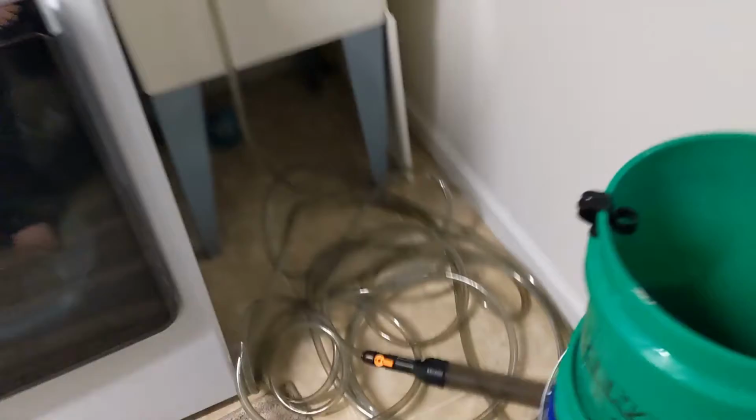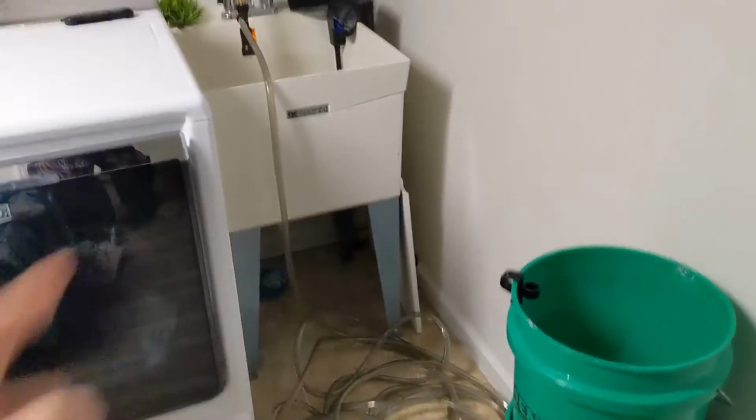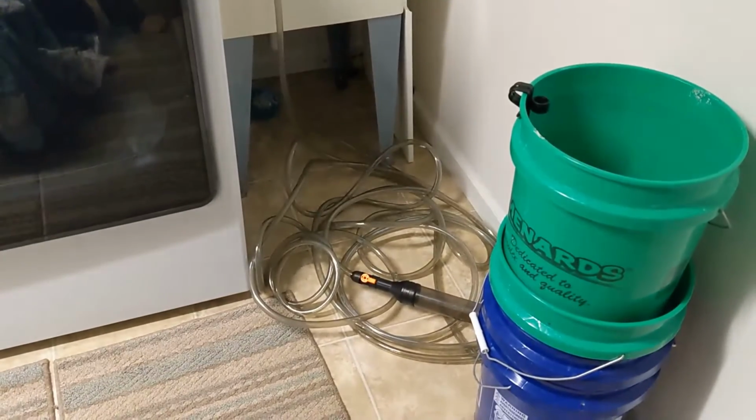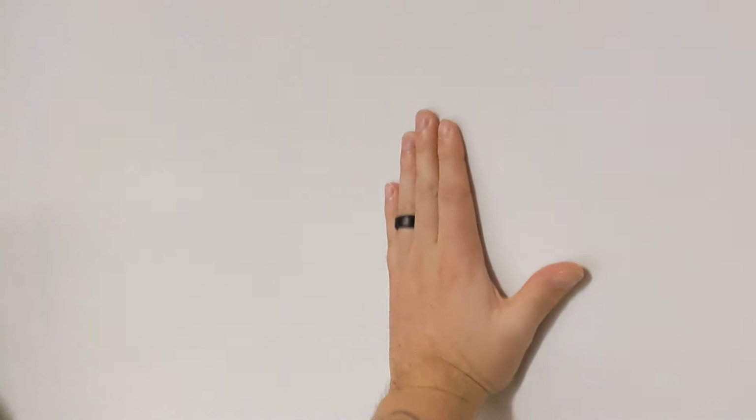So what I'm thinking is coil it up just like you would a garden hose and put a mount right on the wall right here, so that way we can just coil it up on the mount when we're done with it and it won't be all over the floor. Because it's going to be literally just used for hose storage and no one is ever going to see it, I'm thinking we just make a quick and easy mount, literally just a piece of wood up against the wall, a little bracket right here, and then a little ledge so it doesn't slip off, and then the hose will just coil around that little ledge right there. So 3 pieces of wood put together. Sounds like a 30-minute project at most.